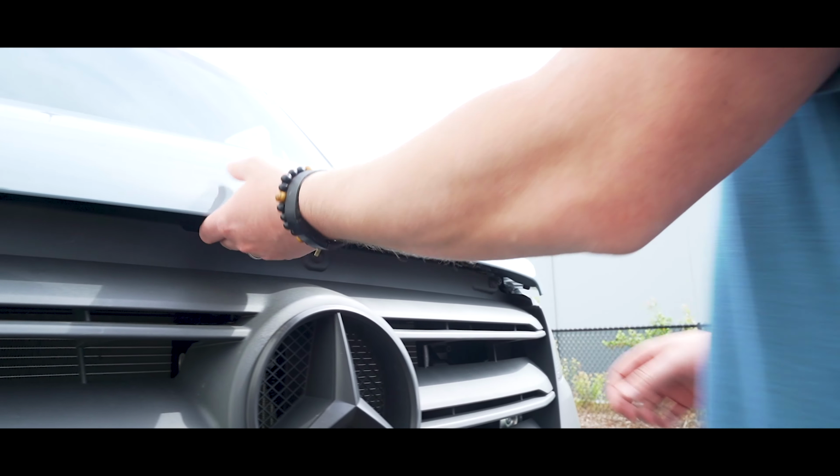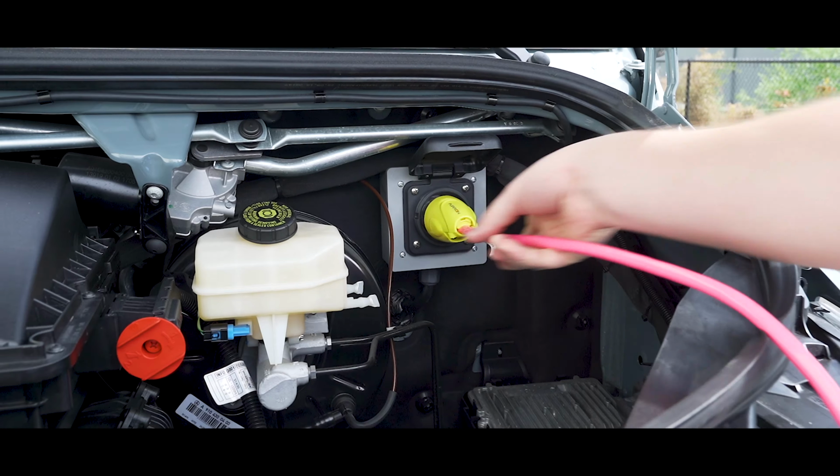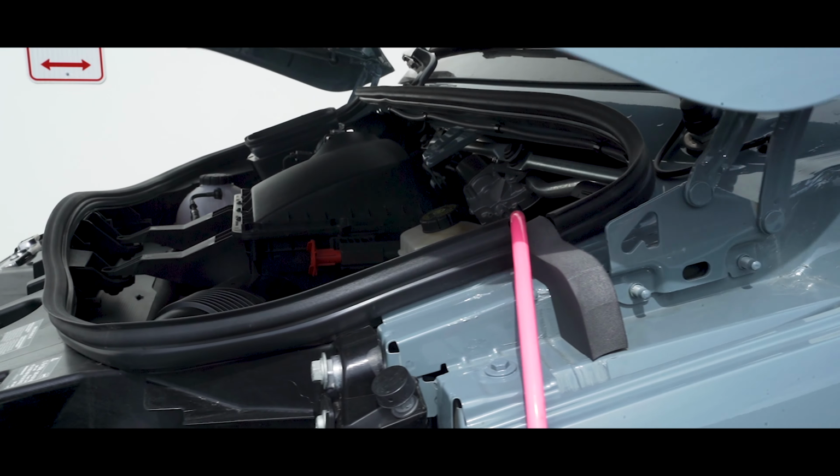As a good rule of thumb, shore power should be used every 21 days for about 2 days, and for 1 day immediately before you plan to use your van, just to ensure your batteries are fully charged and ready for your next adventure. When your van's plugged in, all of the outlets will be powered by shore power, taking the energy drain off your power system. So in turn, try to keep your van plugged in when available.